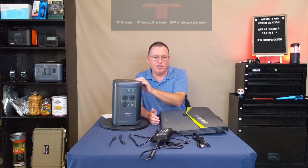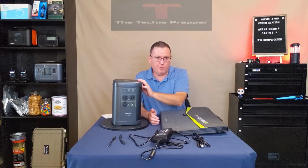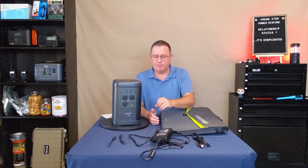That's my own metric that I use, because I've said it in the past, if you're going to use this overnight and you're going to drain it and you're going to use it really heavy, and you expect to use it overnight for lamps, charging phones, running entertainment systems, maybe running a freezer or a small fridge, and you're going to deplete it overnight, you want to be able to recharge that thing to 100% during the next day. And normally you get about 5 to 8 hours of good sun, depending on where you live, and you want to be able to charge it up to full within that time. So this passed that as well. All the charging methods charged it up within 7 hours, so I'm very happy with that.